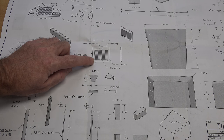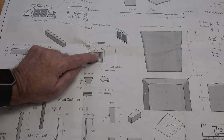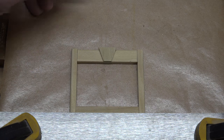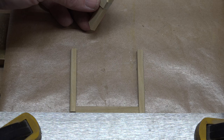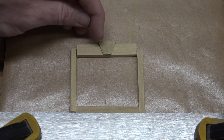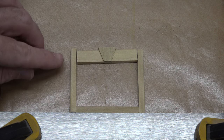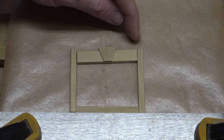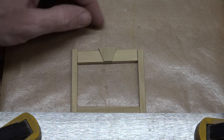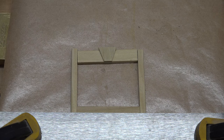So cut all the pieces for your grille and dry fit them together — don't even glue them for now. Wait until the center is done. I've cut the pieces for the front grille; they're dry fit except for the top pieces which are actually glued together. You can't even tell it's separate pieces — it looks exactly as the plans intended and was a much safer process without having to shape that tiny piece. Before you cut these to length, put your round overs where called for; obviously we can't do end grain here, but once everything is glued together we'll add that final round over and contour the corners to the radius routed in the top of the engine block.